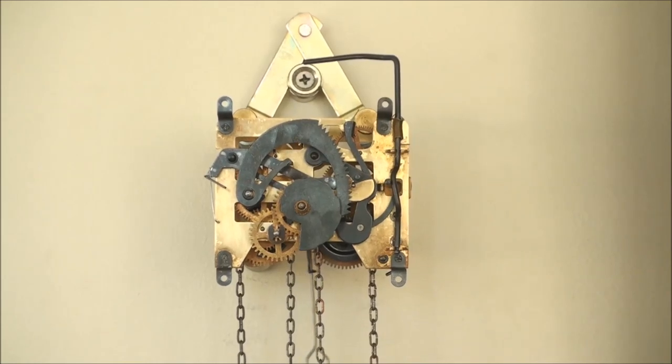It's been running for a day now and seems to be doing just fine. This is how I put in bushings. Some clocksmiths have special machines that press the bushing in once you get the hole the right size, and that works fine too. Realistically, I don't recommend people buy the hand drills to do their own — each bit is around $20 and the handle is about $15, and that doesn't even count the bushings. When ordering online, how do you know what bushing to get unless you use a micrometer? Anyway, thanks for stopping by — please subscribe, give me a thumbs up, and until next time, God bless.